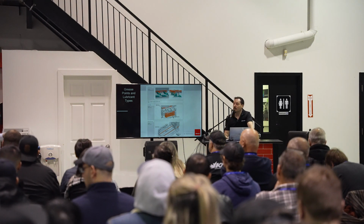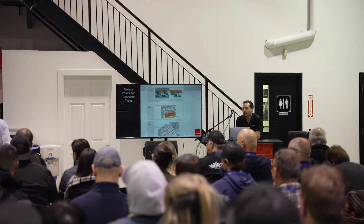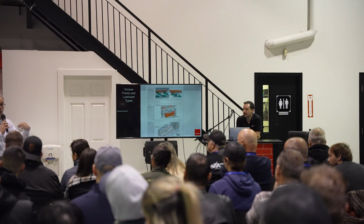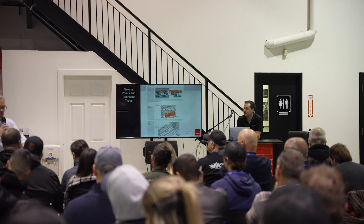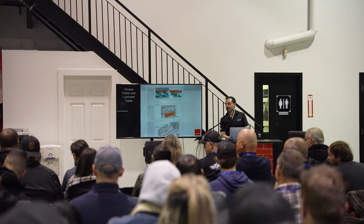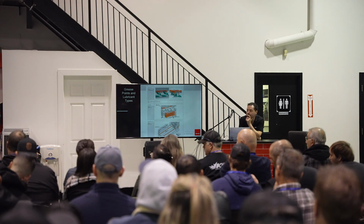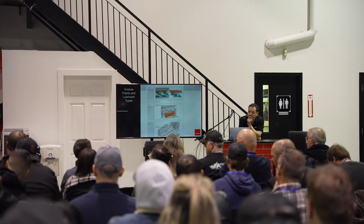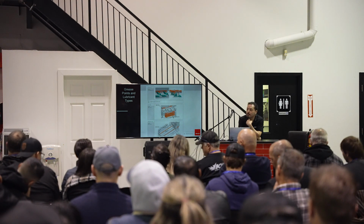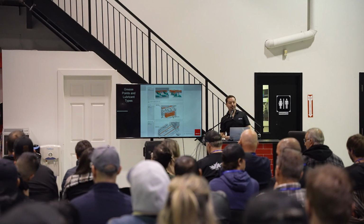I'm just going to pass this around. You guys can just take a look at it if you haven't seen it. This is what the cap top looks like. And on the bottom, there's 2 tubes that attach to that. And then this is what the wiper looks like. So the wiper goes along, for those of you who don't know, along the bottom of the print head to remove any excess ink. So it's really important that you keep that clean. Whether you're using solvent or whatever type of technology you're using, if the ink builds up along that, then it cannot form a seal with the bottom of the print head, and then it can't work properly. So it's really simple to take care of. It only takes a few minutes, but I thought it'd be good for you guys to see what this looks like. Just make sure I get that back after this. Thank you.